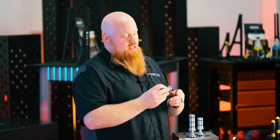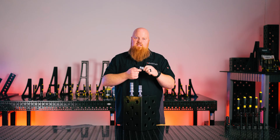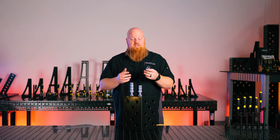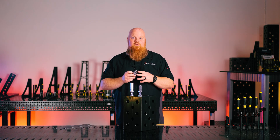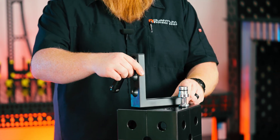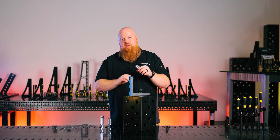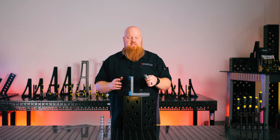It's going to leave it flush and give you the maximum amount of room for welding and fixturing. These are made of aluminum, super durable, with an o-ring so there's not going to be a lot of play in the bore holes of the table or the accessory. We have one of our stopping clamping squares here — we're going to bolt it to this riser block, and this will go in any bore hole on any accessory or table as long as it's a System 28.